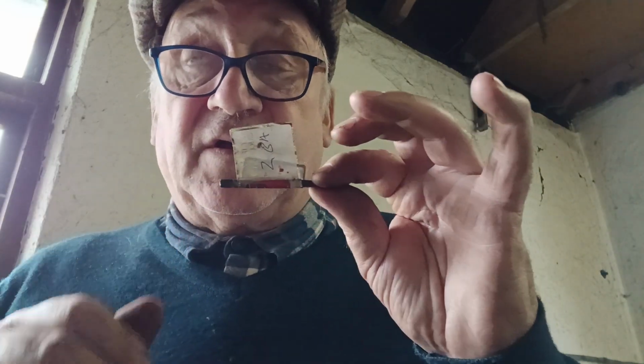So BA nought is the biggest. It's about 0.22, I suppose. 2.1 maybe. And then they get smaller as they go up to 5, 6, 7. Clockmaking, perhaps watchmaking, and very fine things like that. These threads are brought out to cater for that market, and they're very hard to get. And you get taps and dies.